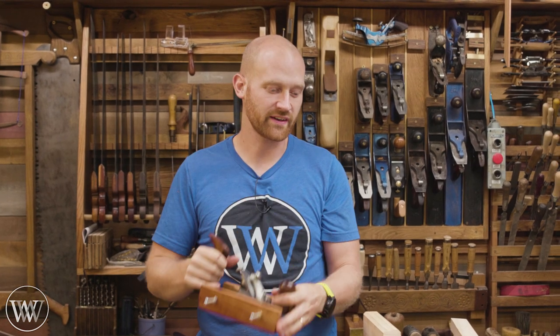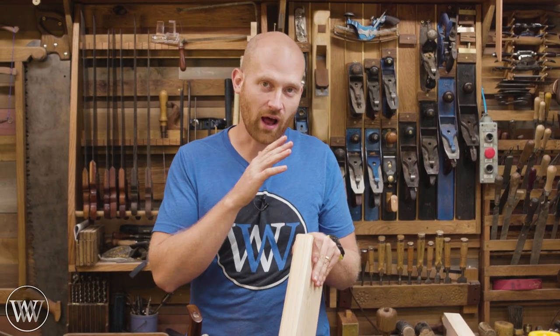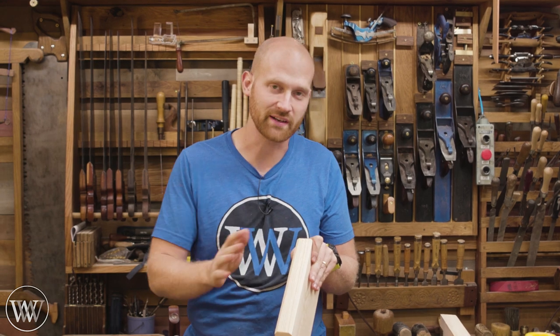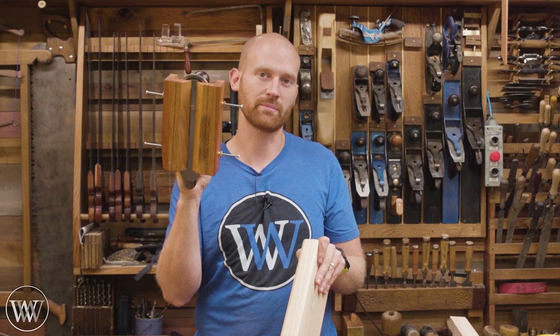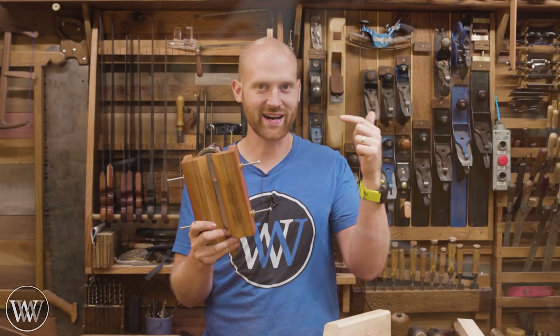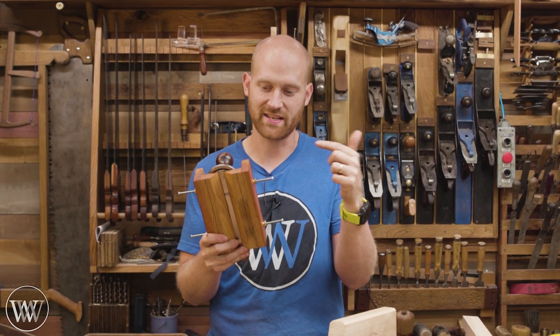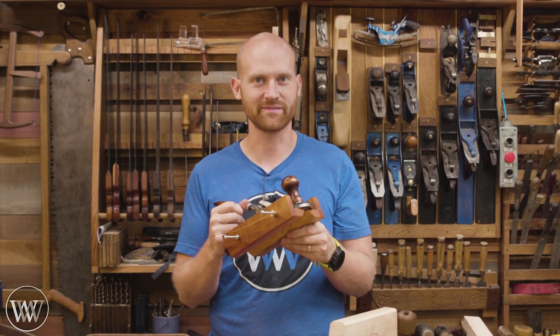There you have it. This is a really simple project that makes chamfers very easy to execute with a very consistent shape — particularly for the table I'm going to be doing soon. I'm going to have a thousand chamfers all over the place and I want them to all be exactly the same — this makes it a lot easier. This is a good bit more time than just taking a block plane and running it down, but this gets more accurate and easier when doing a lot of them. Now, I know the screws on this are a little odd — I'd like to find a brass threaded rod to make it a little more adjustable. That's just all I could find in the short amount of time that fit into my 10-32 screw holes. But I like it and I'm looking forward to using it.